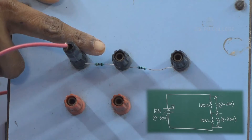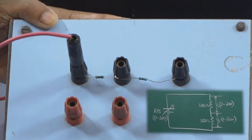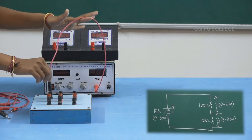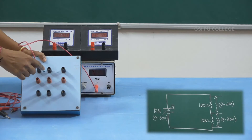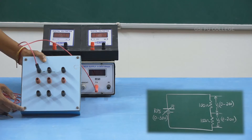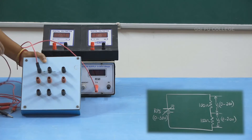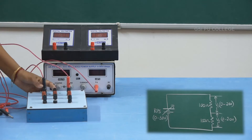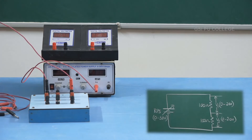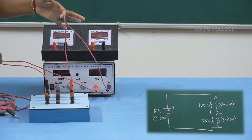This is the easy method. Let us connect the resistors in this manner and continue with the circuit connection. The positive terminal of the power supply is connected to the upper point of the first resistor, and the two resistors are already connected in series. Now let us connect the lower point of the second resistor back to the negative of the RPS. I will be connecting a wire from this point to the negative of the RPS. So I have completed one loop.